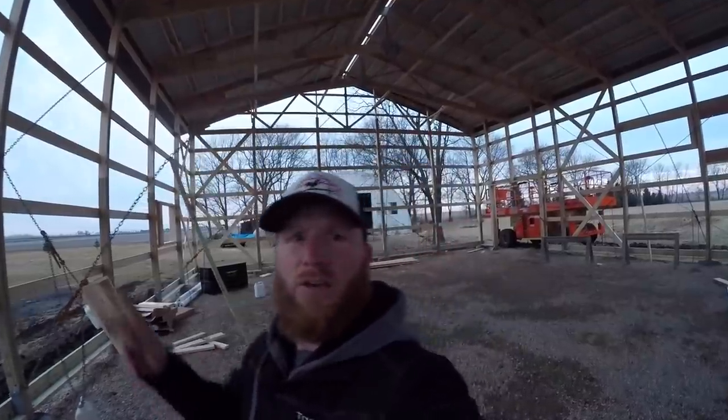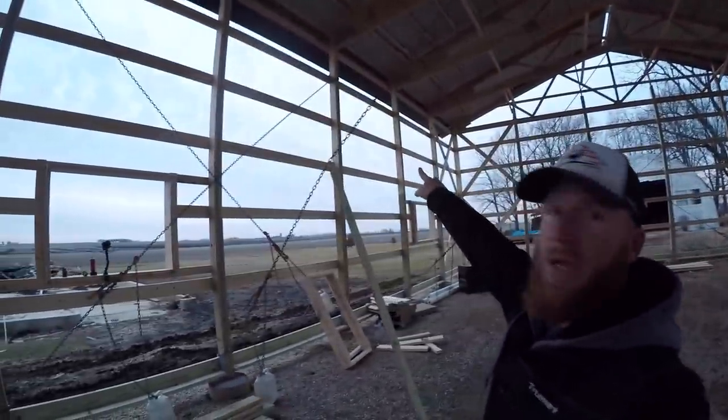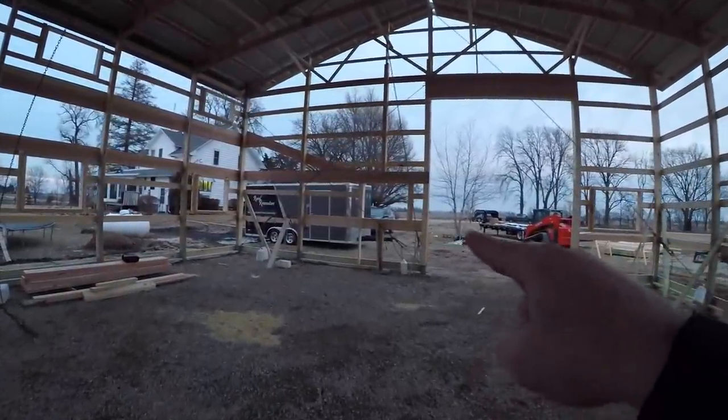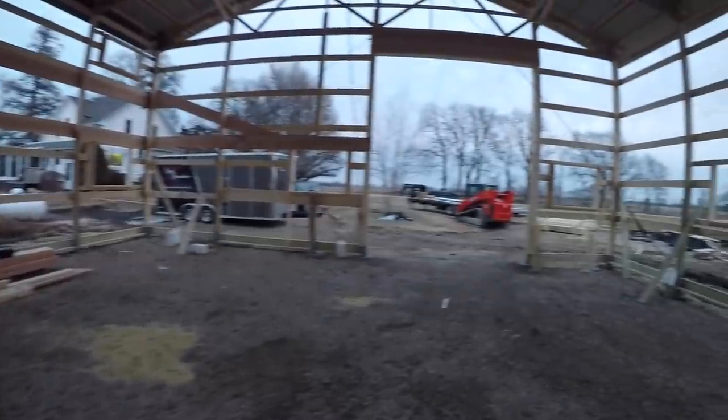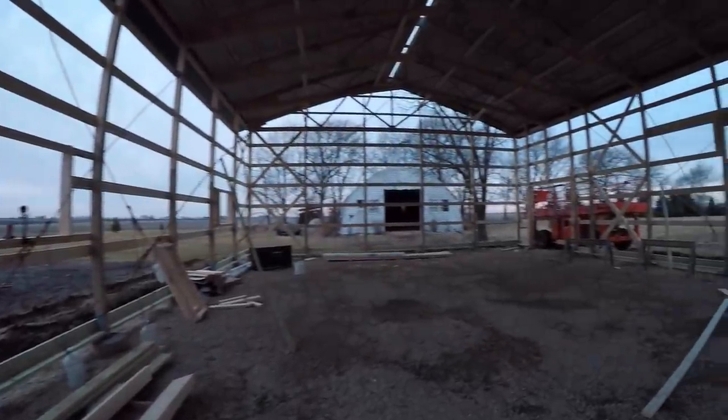We've got two windows to put up here, up high. However, we did get this window fixed, that post cut out, and then we got this walk door done, among some other miscellaneous framing, some rat board, some grade board stuff on the outside. Tomorrow, if it's calm, we'll go ahead and start running house wrap, getting wainscot.